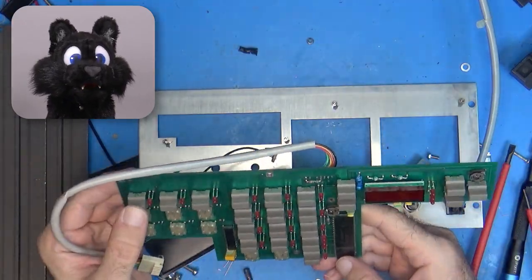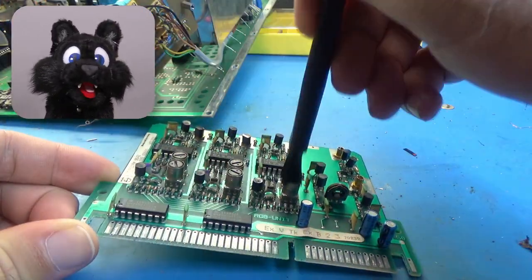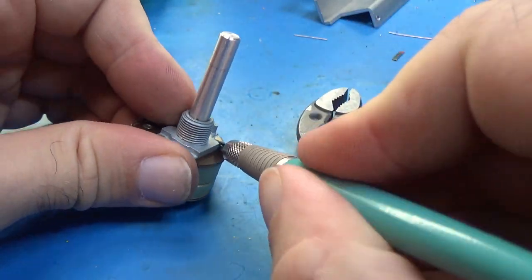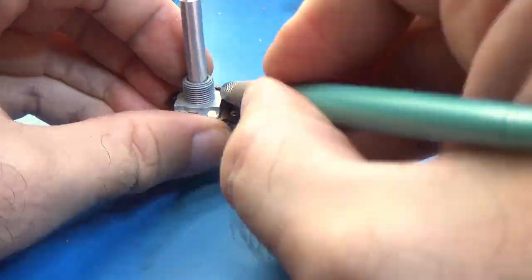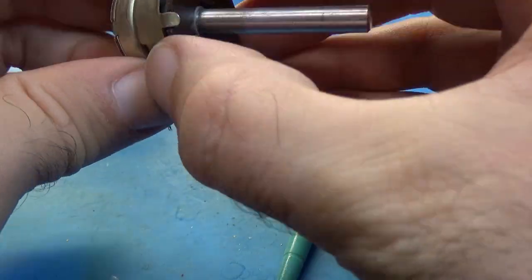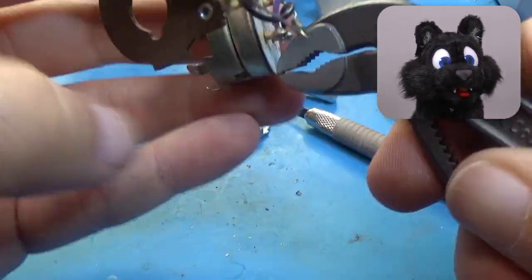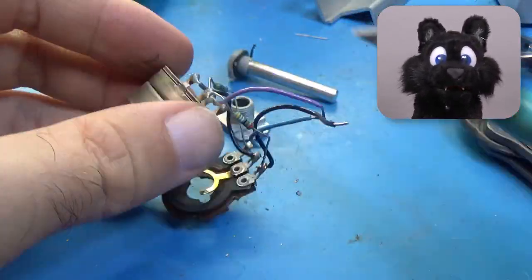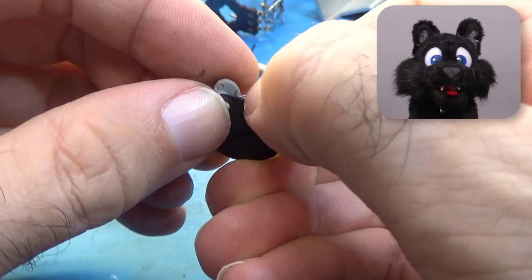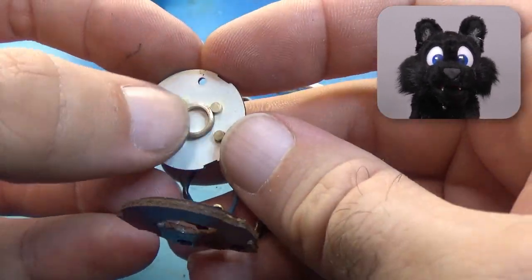I ordered a set of electrolytics along with a battery holder that seemed to be a good match. It's hard to tell if the footprint matches the old battery, though. I used thread-lock to prevent accidental changes, but these old pots are way too stiff. If you can hardly turn it without the attached knob, it needs fresh grease — that's my baseline.